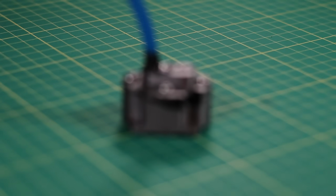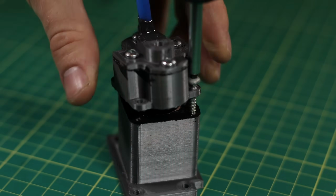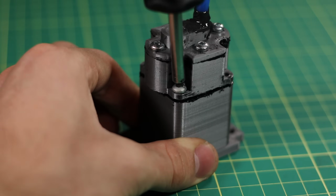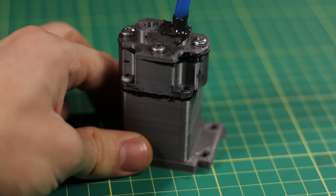And now it's time to work on the cylinder. Instead of using the O-ring head gasket that I was using before, I am just going to seal it with some silicone, because it is going to be subject to higher air compression. Also, I just trust that actually gluing it with silicone is probably going to do a better job than just an O-ring would. Once the head is put on the cylinder bank, we can actually start putting the compressor together and have a first look at how it's going to work.